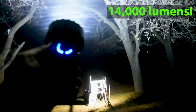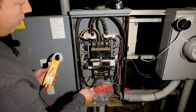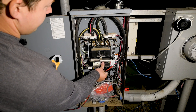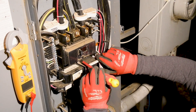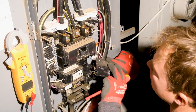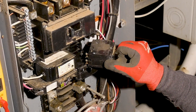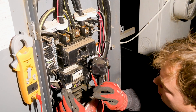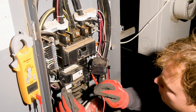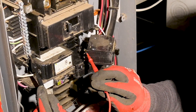We've got the Marauder 2. I don't know if any of you guys have seen this, but this is a really fun light. But look at that dust from harvest. We're going to turn this off and now go ahead and test this breaker to see if it's the breaker itself that's having an issue. Pull it off and turn this thing on — by turning this on, we should have power on these two ends of the breaker. We should have 120 volts from the neutral bus to here — which we do. Let's check the other one. We have nothing. So we actually have a bad breaker, guys. How strange.